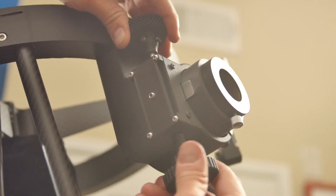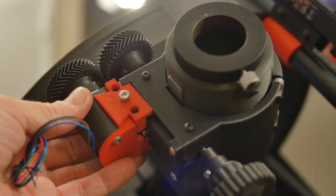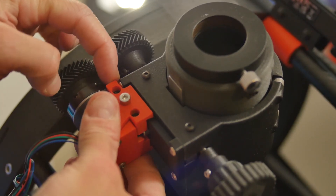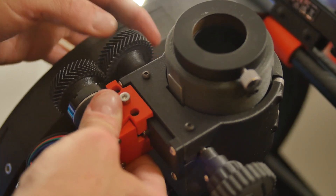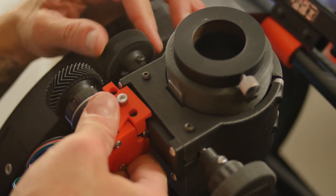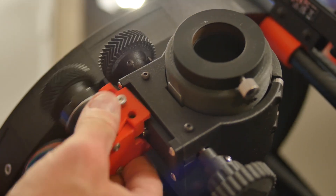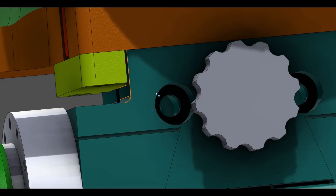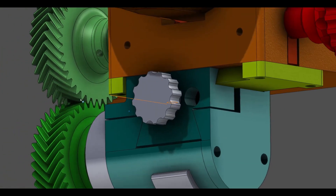The focuser knob on the left is replaced with a matching drive gear. On the first test fit I immediately run into an issue I didn't anticipate — the focuser housing interferes with one of the screws that hold the dovetail bottom plate to the focuser. This required a third redesign of the housing to shift the dovetail clamp back a little bit to have enough room for the screw heads on the bottom plate.